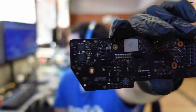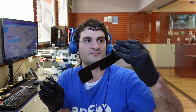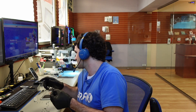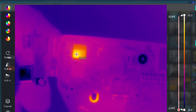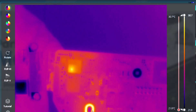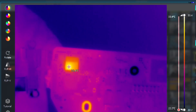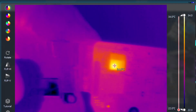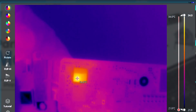We do have these USB-C ICs that are impacted. On the other side you have two of these that regulate a lot of different things. I'm going to put this under a thermal cam — you can see one of the USB-C ICs is actually getting hot and there appears to be some damage on it. It could be damaged to the USB-C IC itself or to the circuit, but most likely there is a problem with the USB-C IC. The top one was the part that was damaged, and it makes a lot of sense that it would be damaged as well.